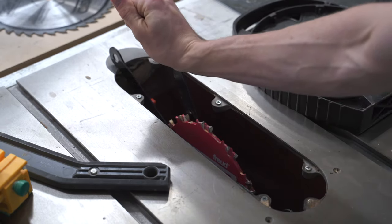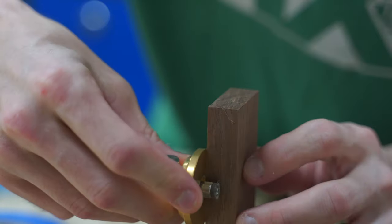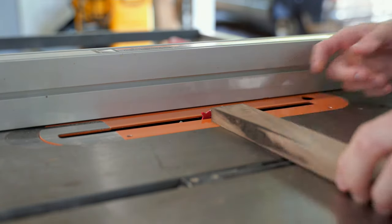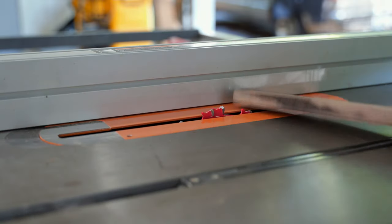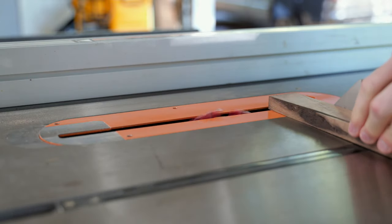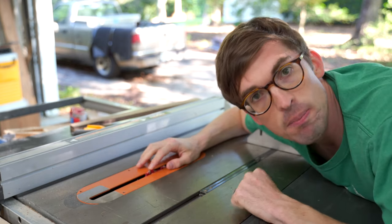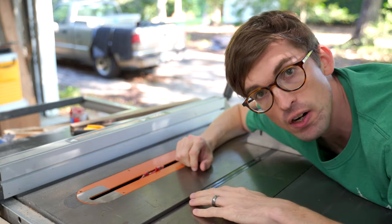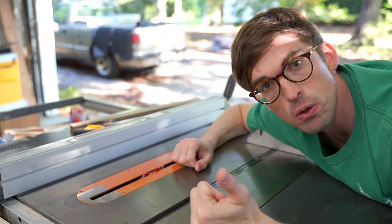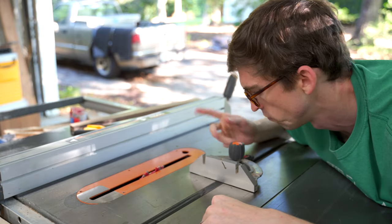I'm going to be attaching that and then just cutting it to the line to make these work. To get the middle of this guy, I'm going to sneak up on it — this is actually just a scrap side — to make sure I'm getting the absolute middle of the cut before making the rest of these cuts. Now that we've got the blade height set to go exactly in the middle, I'm going to use one of the pieces as the actual spacer so I know how far to go in, and then make a series of cuts using this little crosscut miter thing.